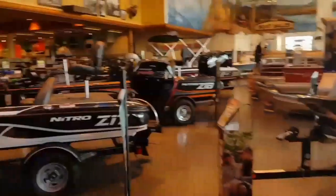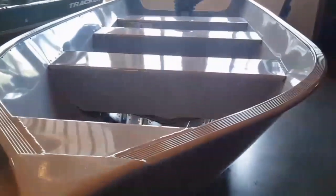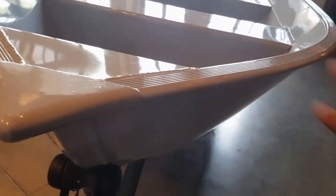The newer the better. Newer john boats are going to be built substantially better than older ones — less stress on the rivets, fewer maintenance problems. Finding an all-welded boat is probably the best bet to avoid leaking and maintenance on rivets over time, because once you convert a floor over them, it's really hard to tighten rivets — you'll have to do secondary sealing with resin and other work. Also be wary of hull flex: if you feel the boat flexing in waves, watch for seams breaking, the hull cracking, rivets warping and bending, and then leaks appearing.